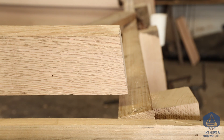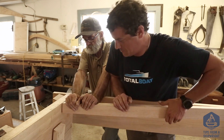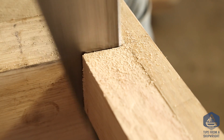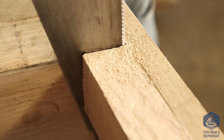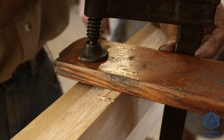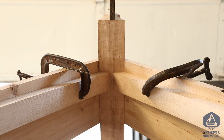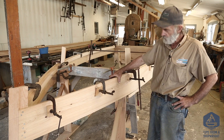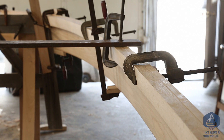The chine log still looks too long, but we're going to bend it well inboard until it fits, then move it back outboard against the planking — and you'll see it almost fits perfectly. We'll take a handsaw just like we did up forward and shorten the ends just a very little bit, being very careful not to saw into the side planking. When you twist it, that'll make it even tighter. So there are our chine logs, right in position — just clamped, not fastened yet, with the clamps pulling a little twist out as they train over the station.